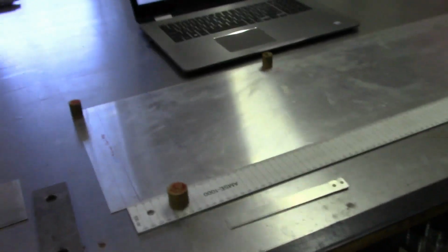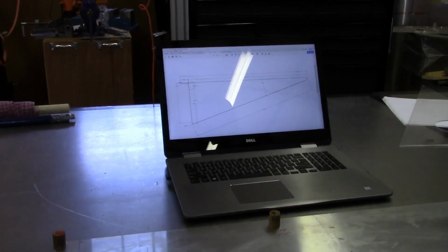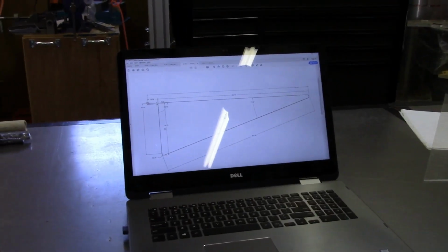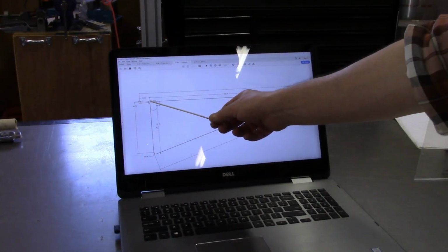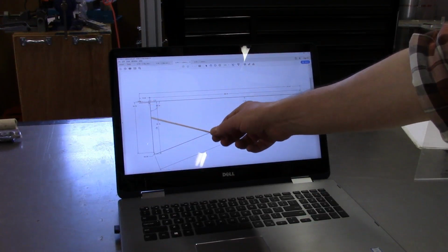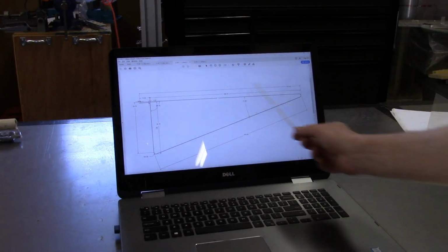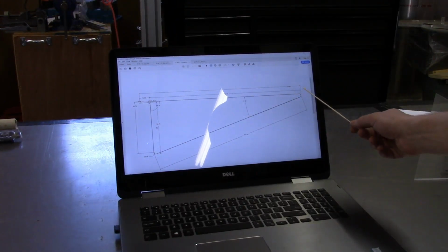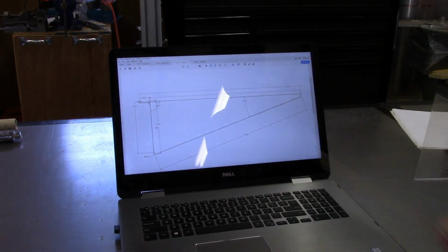Now, the bend that's done here is a little bit different than what was done with the aileron. We can try and get that to focus in properly. On this one we've got the reverse bend, so we've got to take that into account. The thing is actually a little bit simpler than the flap in that I don't have any bends after this acute angle right here. So when I do the bend, it'll be in order of 1, 2, 3. I won't have to do the outsides and then do the middle to get the bend successfully completed.